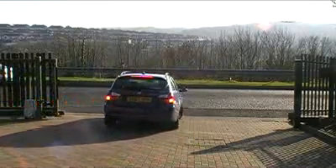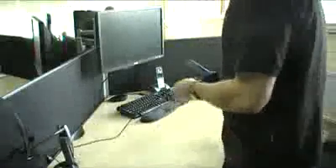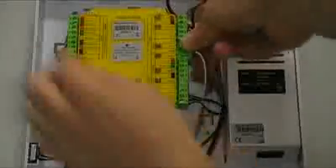With confirmation that the gate can be fitted with the Net2 Nano, Nick begins planning the installation for the site. Now for the installation: plug in your Net2 Air bridge. The reader is fitted and wired to the Net2 Nano as normal. The relay output from Net2 Nano is used to control the gate. The Net2 Nano can now communicate with the server PC, and access permissions can be controlled via the Net2 system and reported on the Net2 software.